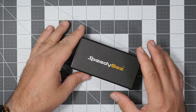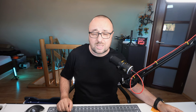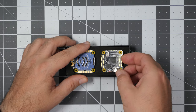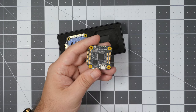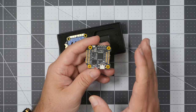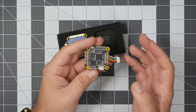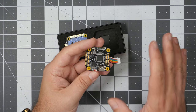The second flight controller I want to show you is the new Speedybee F722 V3 stack. If you ask me, this is probably the best multi-rotor oriented flight controller stack right now on the market. In this one 36 by 36 millimeter board, you get a lot of features: the F722 MCU, half a gigabit — yes, exactly — half a gigabit of flash memory for your black box logs, 8 motor outputs, 5 serial ports, and like almost everything from Speedybee, you get a Bluetooth module that works perfectly with the Speedybee app.